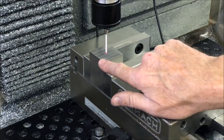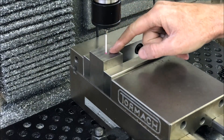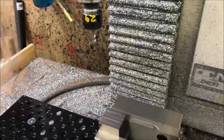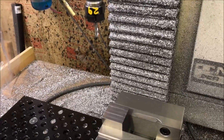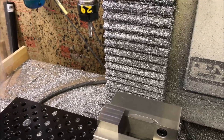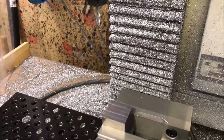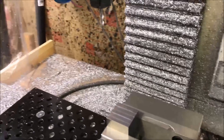I set my zeros on the front corner over here because it's faster to probe, and it's not a really critical part. I'm going to do this whole thing with a 3/16ths four-flute end mill. The feeds and speeds are going to be pretty conservative, so I'll just check back every once in a while on the progress.